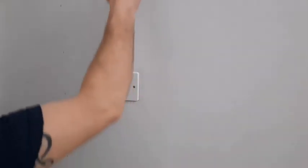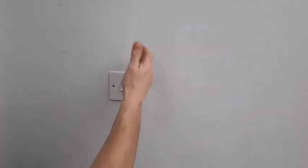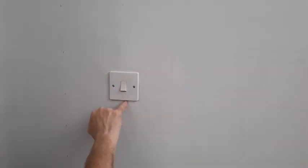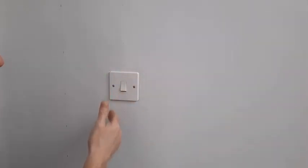I'll show you the middle one now. The reason I'm going to show you both is depending on how long between lengths you are, if each length is soaking for 10 minutes and you might not be coming back to put the next one on for another 10 minutes, you want to cut the paper off the other side because paste can dry fast and it can make it more awkward.